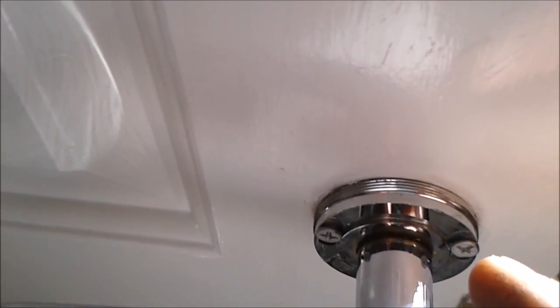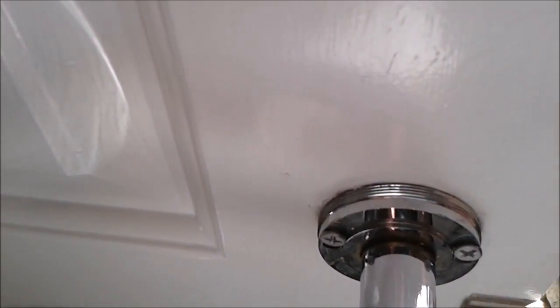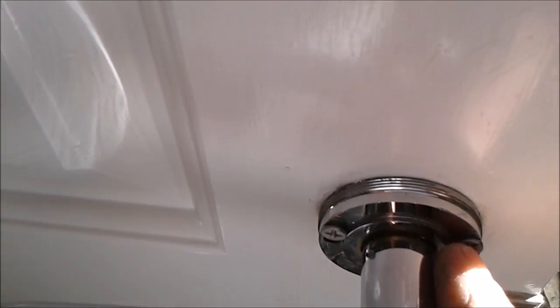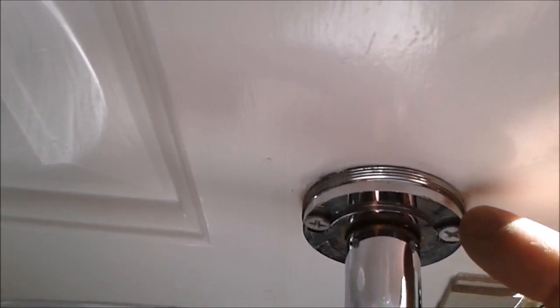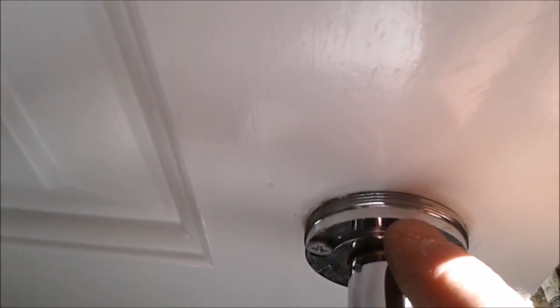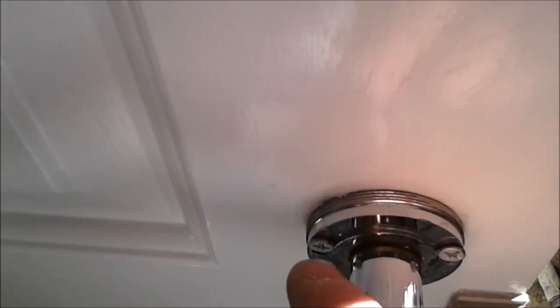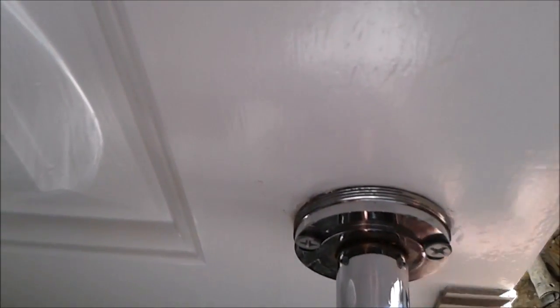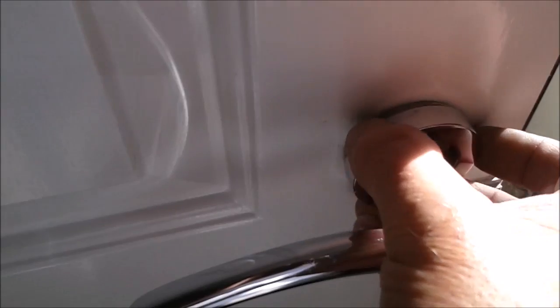Because I've had to use some oversized screws, this cap won't go back on. So what I've done is with my file, just taken off the edge of the screw — the thread only starts part way along so you won't damage the edge. Just file the end of the screws, one underneath as well, and that way this cap will go back on.